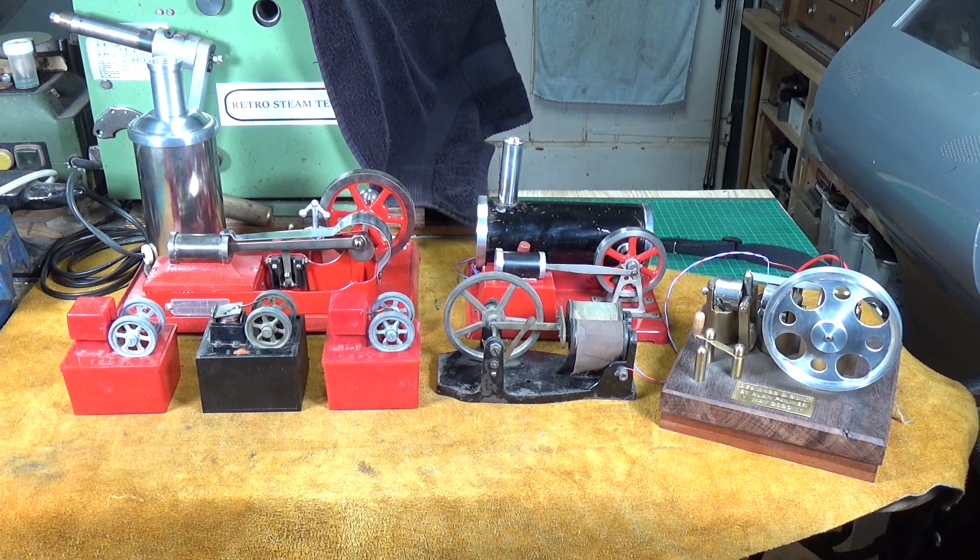It is — it uses an electromagnet — but a solenoid has a moving part, whereas a traditional electromagnet does not have any moving parts. It has a fixed core. These all work on the same principle: the electromagnet or magnets are switched on and off and they attract an arm, and basically that creates the mechanical movement. The arm normally has a lever attached to it which operates a crank — that's what happens in all of these engines.